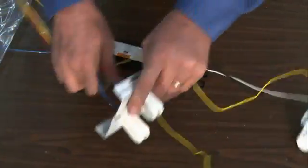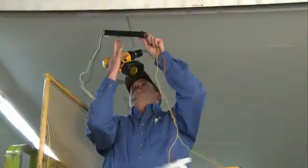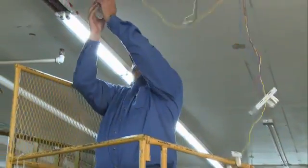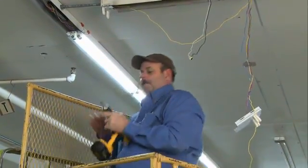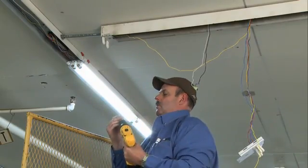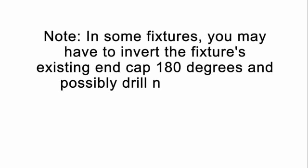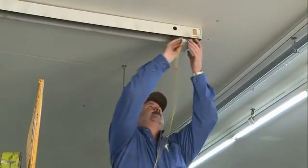When you have connected the respective conductors from the new T8 ballast to the socket plates, you're ready to install the left, center, and right socket plates to the lighting fixture housing. Starting at the left side of the fixture, invert the left socket plate and push it up and into the location of the original socket plate. Make sure you place the socket plate against the end of the fixture housing to accommodate the full length of the new T8 fluorescent lamps, which are approximately 46 inches long. Secure the socket plate by driving the supplied self-tapping screws through the slotted holes. If necessary, reinstall the end cap into the existing holes on the housing fixture. In some fixtures, you may have to invert the fixture's existing end cap 180 degrees and possibly drill new mounting holes so that it will accommodate the left and right T8 socket plates. Dress the wires and push them up and into the fixture housing.